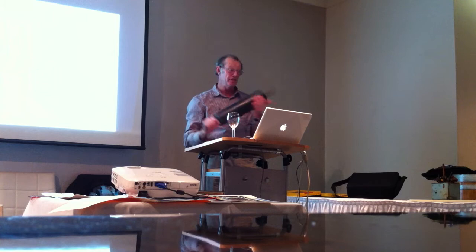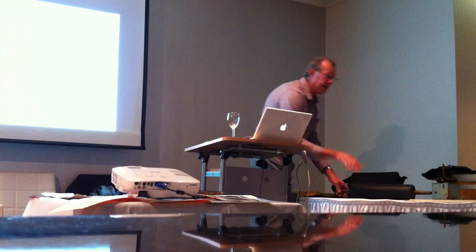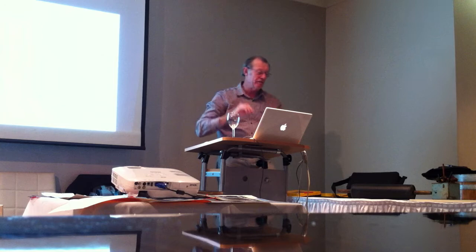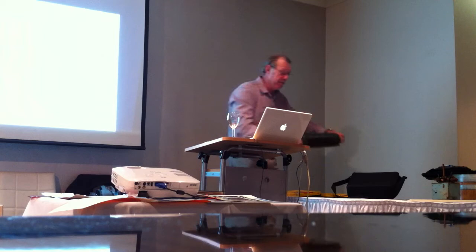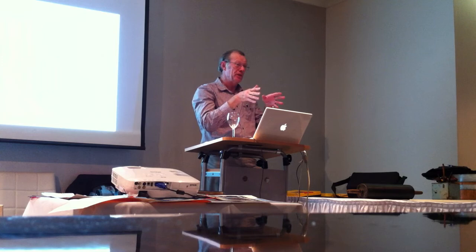What you did is you rolled ink on a glass slab, covered in ink, and you would take the printing plate with the printed image on it. Now this was unetched, so it just has an enamel image laying on it, a fraction of a millimetre sitting above the surface. Once you put an etch on it, that would eat in. Before the acid started undercutting the image, you'd take it out, dry it, then roll ink across the face of the image. You'd put a resin on it and heat it up. The resin would bake hard, and mixed with the ink or pitch, it would run down the sides of that raised image.